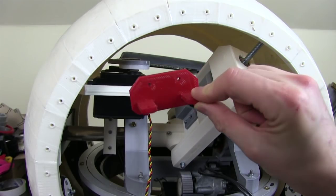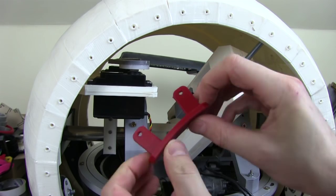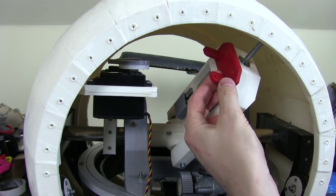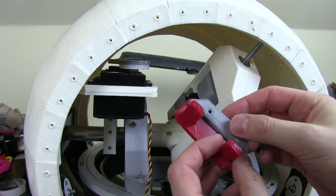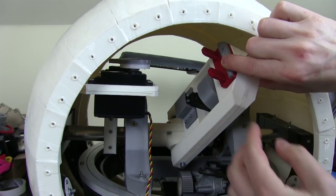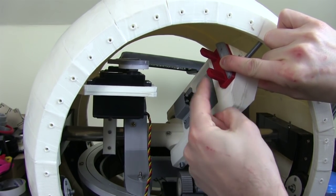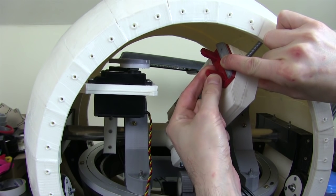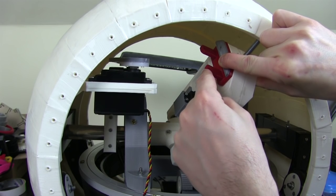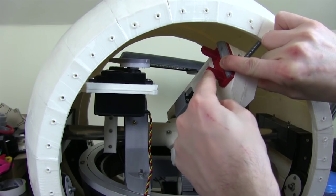I've printed a piece, and this is printed on the Lulzbot Mini Flex extruder, so it's made of Ninja Flex and I can bend it. So this is going to mount up on here, and I've got a little shim that I made out of rigid ABS which can screw on to hold it to the two screw holes. So that goes on there, and that of course is the two mounting points, so these can bend and they can twist as well a little bit, which makes a sort of all-in-one universal joint really. They're also quite rubbery to push, so there's going to be a bit of flex which will act a bit like a dampener if there's any short sharp shocks.